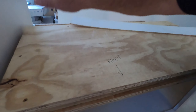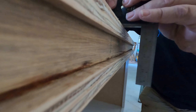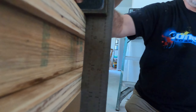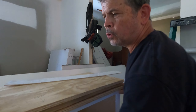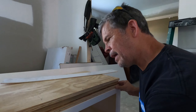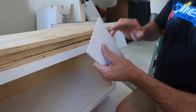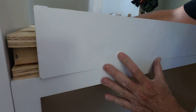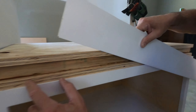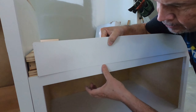We've got our wooden sandwich — our wooden spacer, whatever you want to call it — back inside on the sink base with 'front' marked on it. We just screwed this together, but these edges need to be square, so we used our combination square. Once they were square we screwed it together. They need to be square because that's where we'll fasten a quarter-inch panel skin the cabinet manufacturer gives you, then use a pin nailer to nail it right here so it's flush.